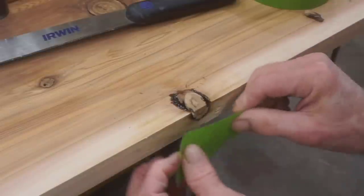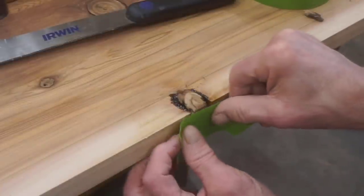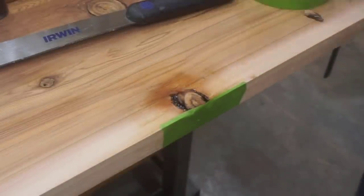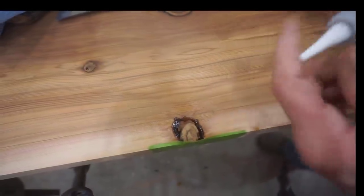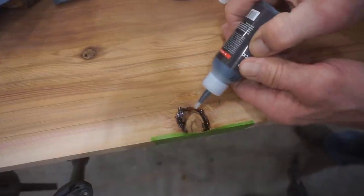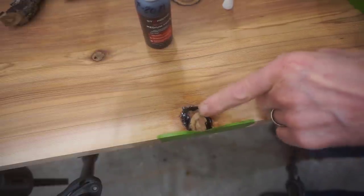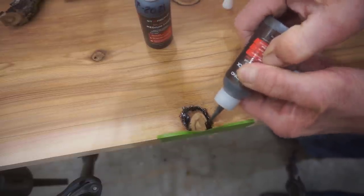Because the CA wants to run so much, I'm going to spray this with accelerator, really well — not puddling it, but a good wet coat of spray. I'm going to tape this thing off. More accelerator in here, and now I can get to the void behind here. Because there's black bark on that knot, I'm going to use some of the black CA for this. This is medium thick and a brand new bottle. I'll just puddle this down in there a little bit at a time, a little more accelerator, a little more CA. All the different CA colors behave the same way.